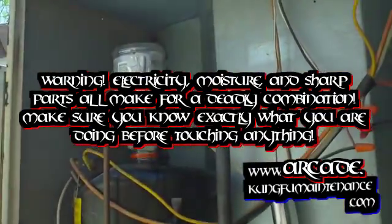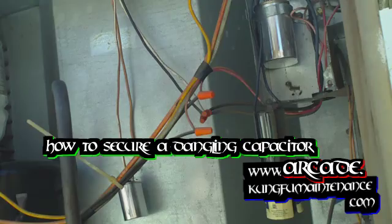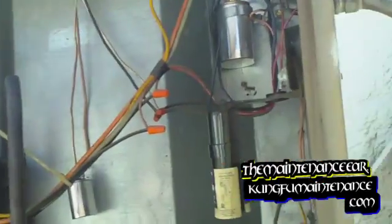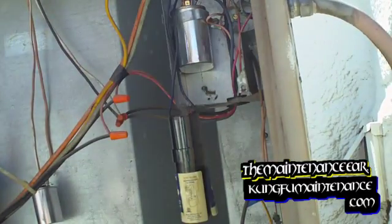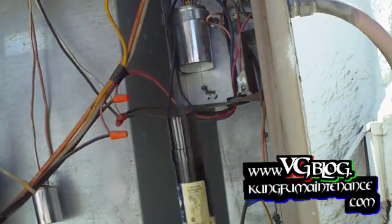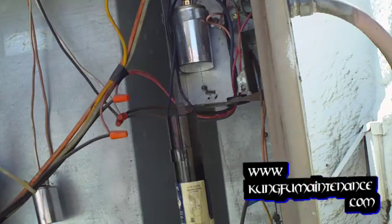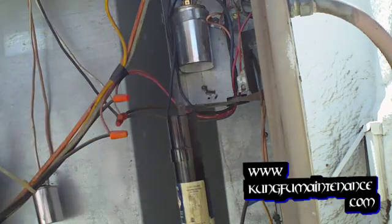Today I've got an overheated compressor. Went ahead and pulled my disconnect, discharged the cap — got a dangling capacitor there, got a video on how to secure that and make it better. I got ice on the compressor to cool it down. My suspicion is that it's the hard start kit that has gone out on this. I can see it's pretty much discolored. I've already discharged my run cap, but since I'm here, I'm going to go ahead and replace the capacitor and the hard start kit all at the same time.